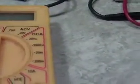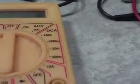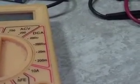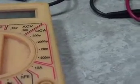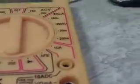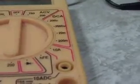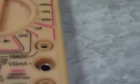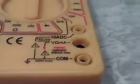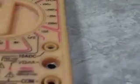Next on the meter face, or the selector, we have DC amperage, and that's if you want to measure the specific current flowing through any electronic or electrical device. If you want to know if a circuit's drawing too much current, you can hook your meter leads up in a way that you can measure that and see what it's measuring. We're not going to concentrate too much on that right now, because that's not really what we use it for. This particular meter can measure anything from 200 microamps to 10 amperes.